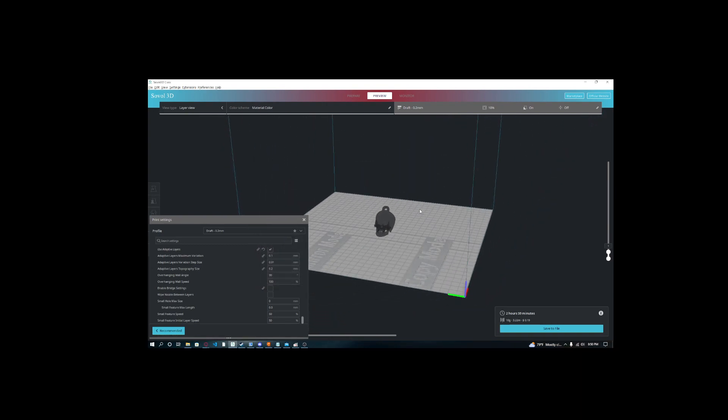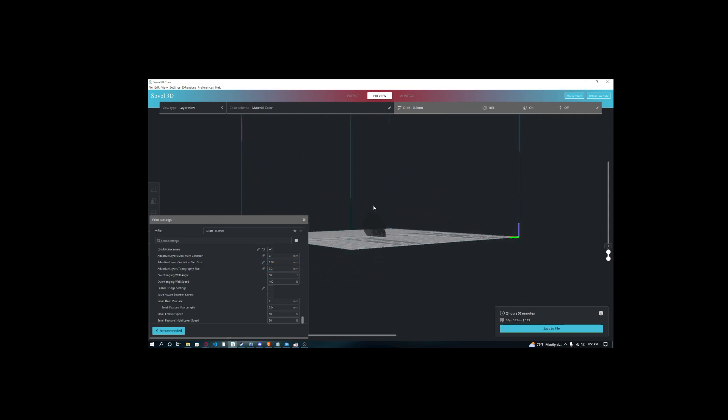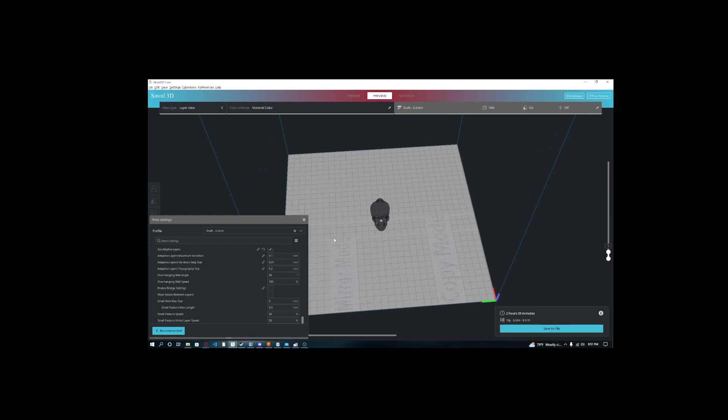I hope this helps anyone who's having trouble with their Sovol. This command was already running on my Ender 3 Pro whenever I installed the BLTouch — it just helps a lot to probe every time you print an object, because it helps with consistency and makes sure your first layer is actually good.